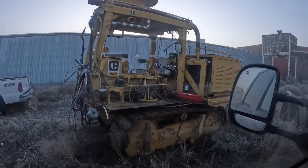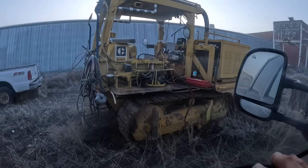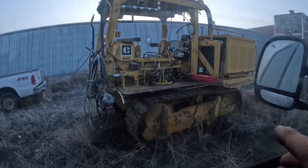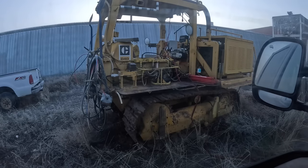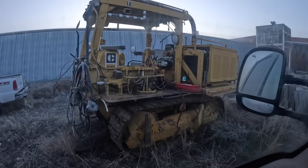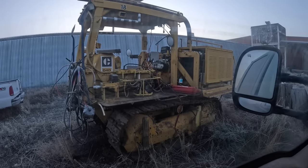So, when they had those dozers, I did three of these up here, and if you remember, I did pads, the whole nine yards. I bought the pads, the rails. A lot of you guys call them track chain. We call them rails here. But track chain, pads, sprockets, and any rollers that were bad, I changed while I was there. Well, the other three dozers were done down south. And it looks like to me one of them they didn't even do the undercarriage on, which I've got in the shop in there. That's the one with the engine we're framing, which that part's supposed to be showing up tomorrow.